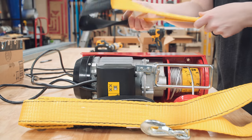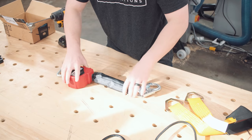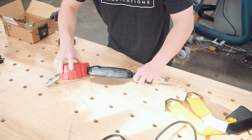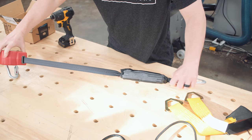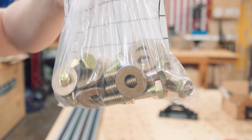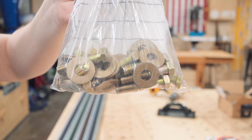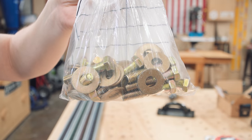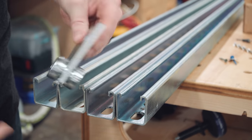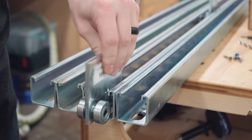The one that I picked up has a 500-pound single line and 1,000-pound double line lifting capacity. The hoist comes with two lifting straps, and I'll be using the shorter strap as a means of attaching the platform to the hoist. For added safety, I picked up a fall arrester, and unfortunately I ordered the wrong size. This one is just under the 500-pound capacity for the lift, so I need to either replace it for a larger one or add a second one of the same size. A bag of half-inch bolt hardware is needed to connect the trolley blocks to the platform, and if any of you out there have access to a tractor supply store, they always have the best prices on basic hardware. Four trolley blocks will be used inside the super strut to keep the lift tracking vertically, and these are just steel plates with four bearings on one side made to fit inside the super strut.